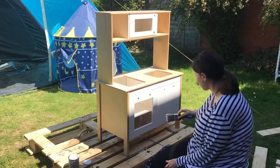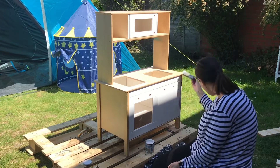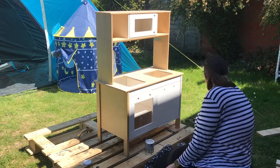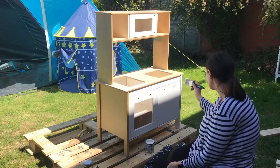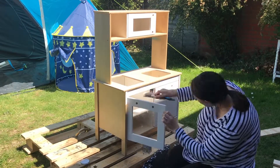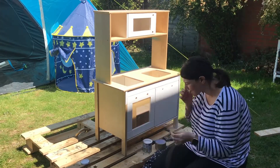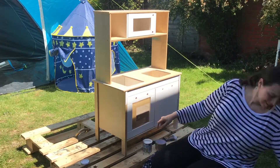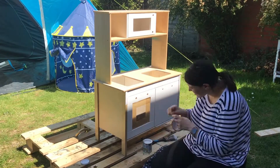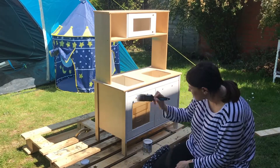Next up I'm priming the whole cupboard. IKEA furniture has a shine to it, it's glossy, so I read that you need to use a primer to make sure that your paint will actually stick onto it. I'm also just using some parcel tape and masking tape to cover up the windows. I hate painting, it is the bane of my life. I'm so impatient but I'm just going to town with this white primer, making sure it goes all over the wooden areas aside from the top counter.